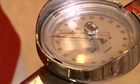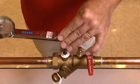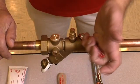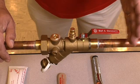Bell & Gossett has determined the following torque values to ensure a proper drip-proof seal. These values are printed in our technical bulletin which can be found on our website at www.balancevalves.com. Once we've applied the proper torque value and removed all the excess sealant, we are now done with our procedure and can open up our ball valve and bring our valve back into service.